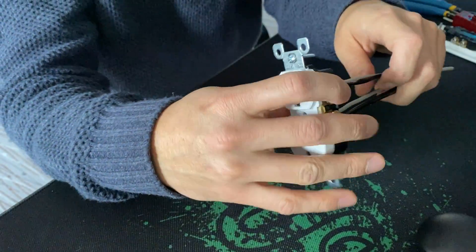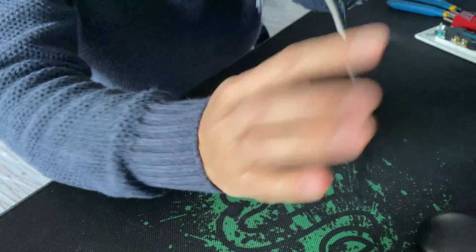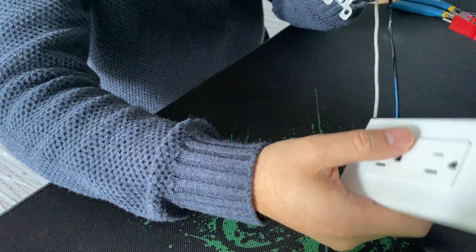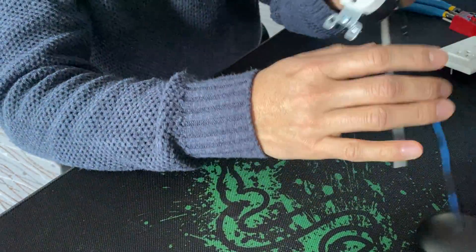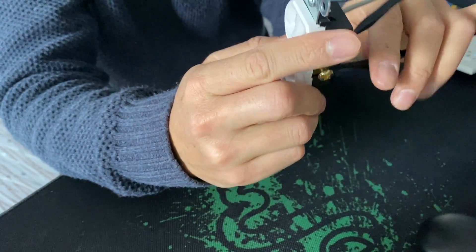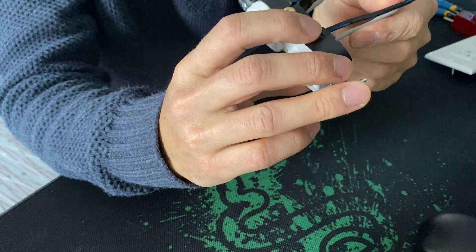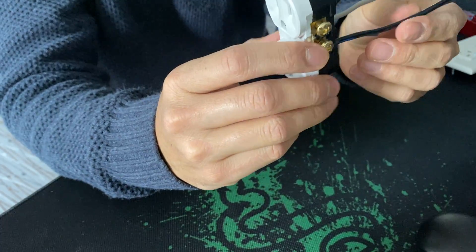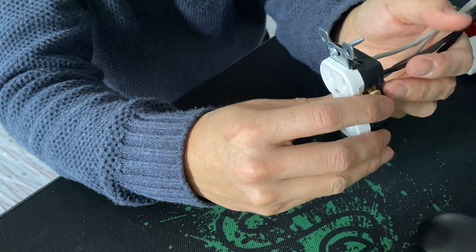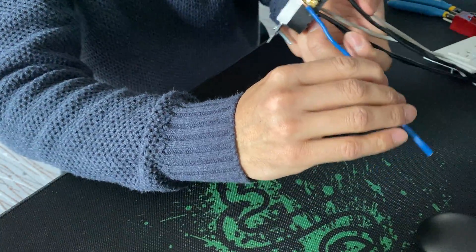When you pull out the outlet, many times it's set up so power comes into this outlet and then goes to another outlet — basically a daisy chain. Somewhere in that circuit you have a loose connection. In my experience, this type of connection fails many times — I've seen these terminals get melted because it will work for some time but these types of connections are mostly problematic.